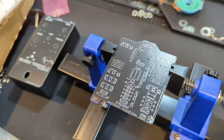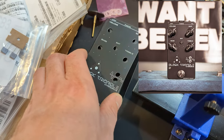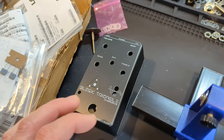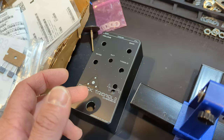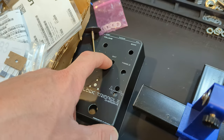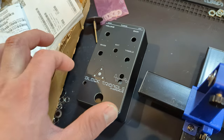Today is a real-time build video, step-for-step on how to build your very own Black Triangle overdrive. This overdrive is a Vemuram Jan Ray circuit, but my tweaks are not to the circuit itself — they're to make it more accessible. For example, the clipping section was normally an internal dip switch, and the saturation required a tiny screwdriver. I didn't like those two things, so I externalized them to make it super simple for anyone to find the tone they're looking for.